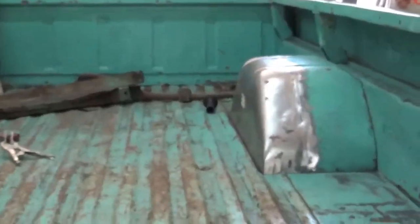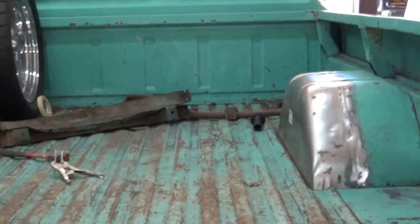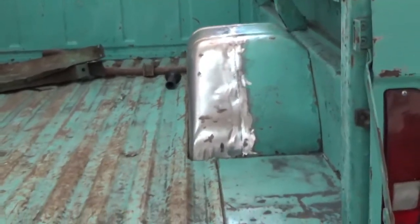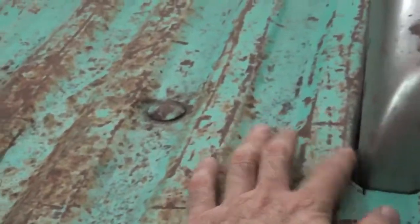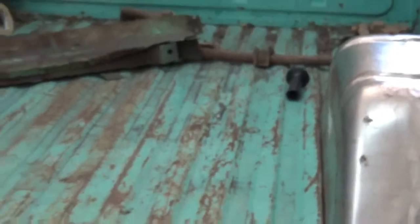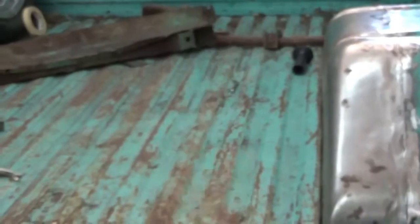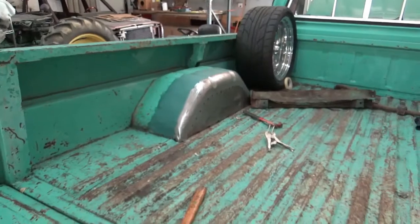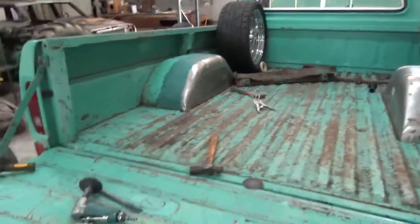All different applications are different, guys. Depending on what you're doing, how you want to do it, how you want it to look. But you still got to get some of the basics. Like some of our real basics here, we needed to get this edge that folded over. We needed a nice edge for that to fold over to. That's important, whether it's an inexpensive job or an expensive job, so it has something to stick to. So, all right, let me finish putting those spot welds in, then I'm done with this.